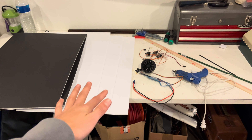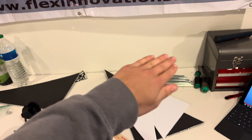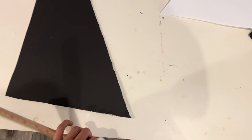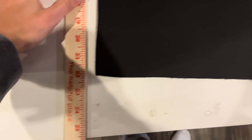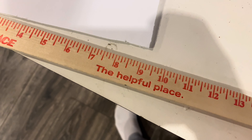I'll show you all the measurements you need. For your first step, you're going to need to make your wings. You don't have to mold wings like you do with a lot of other foam board planes — it's super simple. Basically, you need to make one larger right triangle, measured at the bottom at about 12 inches and the top at about 22 inches. Then you need to make another smaller right triangle that's about 17 inches by 9 inches.